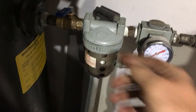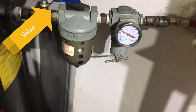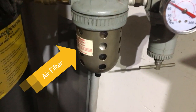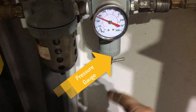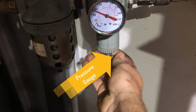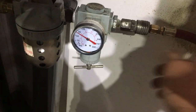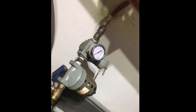Over here on the outlet side of the tank, we leave out through here. I have a valve — so I can actually turn this on now, you hear the air going in. We go through a filter, basically a little bit of a water separator — you can actually see some droplets of water in there. To the actual gauge pressure — here I can adjust the pressure up or down of what I want my tools to run at. Then they're fed to a coupling and out into the hose. That is essentially our whole system.